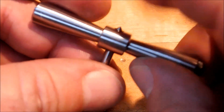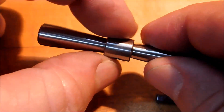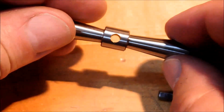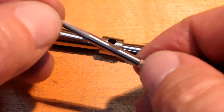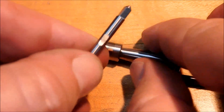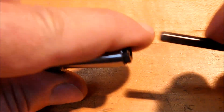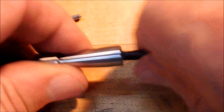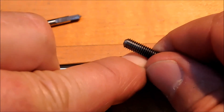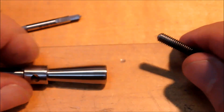You can stick a spring-loaded center on there if you want, but I found out that sometimes there is not enough protrusion — you can thin it out, you can do whatever you want. This is a tool that you made and something you're going to have and use for a really long time. On taps that you want a little bit more effort, put a small flat on it — take it over to the grinding wheel and just bump it on the edge. That's the flat that you register the screw into, so it's not going to slip. Put a nice 45-degree cone on the front of your screw — that way when you do press down on your tap you don't damage the thread, you only flatten out the point. Keep an eye on that point as you continue to use this.